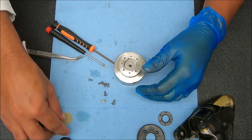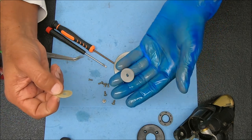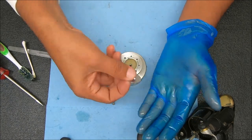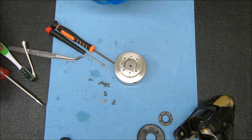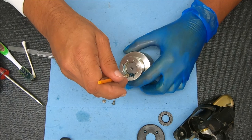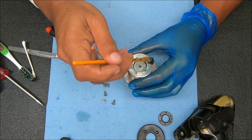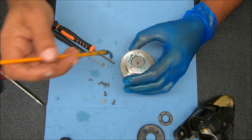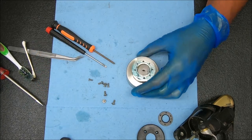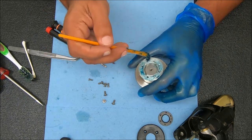For the stack: one drag washer, one keyed washer, then one drag washer, one keyed washer. The final piece is this and this. At this point we can take some grease — be light with it since we're using a different kind of grease around the edge. We'll do the holes as well so nothing gets stuck. I'm going to do all the holes because it'll take too long to figure out which ones to do and which ones not to.